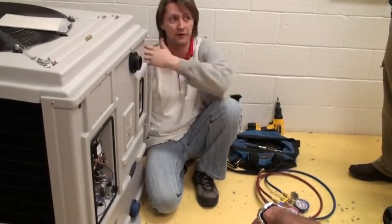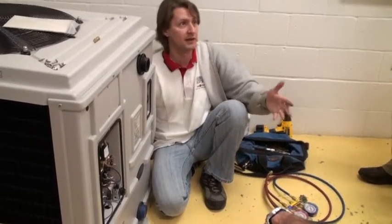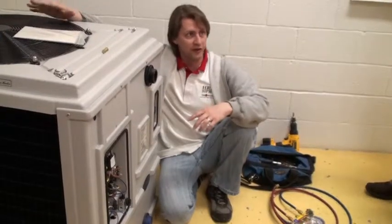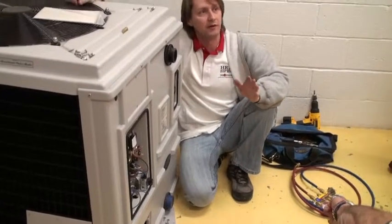But maybe you can't — maybe it's loud, maybe it's right next to an air conditioner and it's loud. So the fan's on, the air's blowing, but the customer's saying it's running but not heating. One thing I'll say is: is the air coming out cold? If the air's not cold, then there's no refrigerant moving to cause a heat transfer. So when you come out here, you're thinking this is a possible compressor failure.